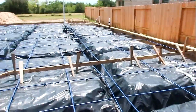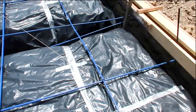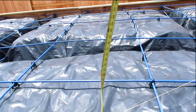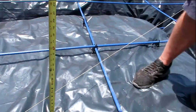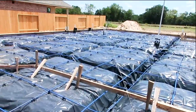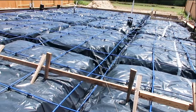To figure out the thickness of the slab, you can see we have a pull string showing how high the concrete is going to be poured. You'll use your tape measure and measure the thickness. We don't usually have the string, but it's really nice. They put this pull string in and you can see we're sitting at five and a half inches, and the plans only call for four to four and a half inches. It's okay to have more, just not less. Randy measured it in several spots and it's five and a half inches and over — they're going to have a really thick piece of concrete here.